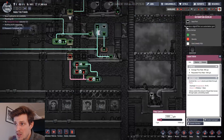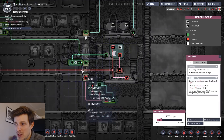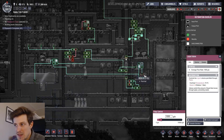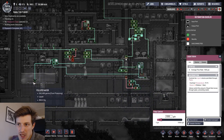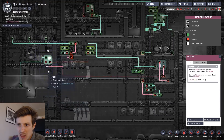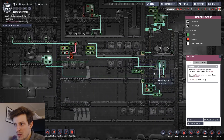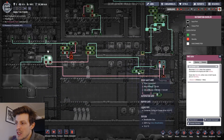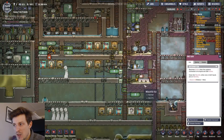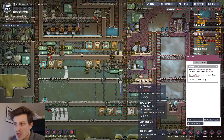The other thing I have is the failsafe, and pretty much the failsafe will just cut the power directly. You can see I have another input here — it's this little automated setup — so it will sense how much water I have. This thing will only start happening if I have enough water. It's connected to a couple of buffer gates; if this one hits, it goes up to an AND gate, which means if there's enough water here plus it's not too warm here, then it will actually run. Otherwise it will cut the power already up here. It will also cut the liquid flow, because if I keep dropping liquid down when this one is off, I'll get so much liquid that it won't be possible to heat it — it will overflow.